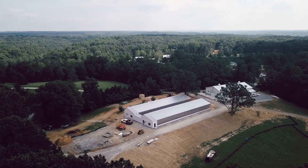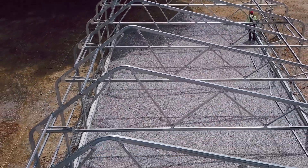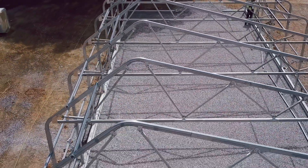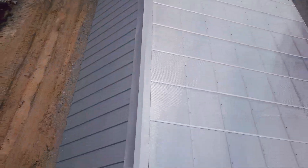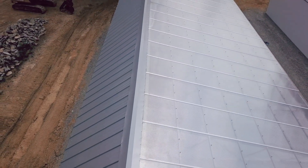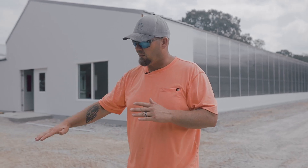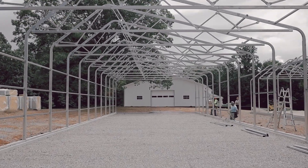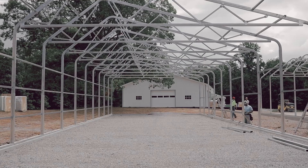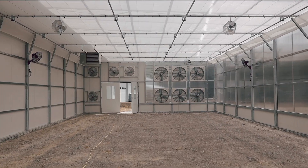A series greenhouse always runs east and west, always has a south-facing side and a north-facing side. With a standard traditional pitch breaking in the middle, you'd lose light exposure to approximately 10 feet of the north wall. So we accentuate a 3-12 pitch 24 feet out in a 30-wide and then go to a 9.5-12 pitch to give a full spectrum of light four feet up the north wall, so on June 21st when the sun is at its furthest point north, light will be direct four feet up on that north wall.